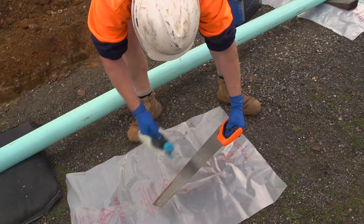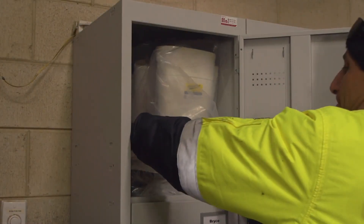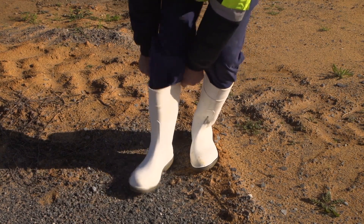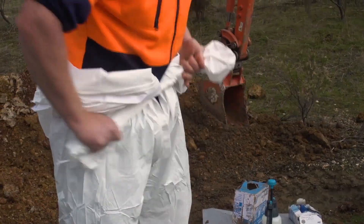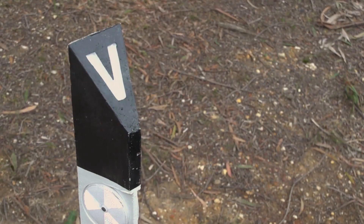AC bags make a good ground sheet for this purpose. Thoroughly spray the tools and fittings with a sodium hypochlorite solution. To prevent contamination from the workers themselves, disposable overalls and rubber boots dedicated for water work should be used. These can be white boots or normal black boots identified in some way. In hot weather, the overalls can be rolled down to the waist.